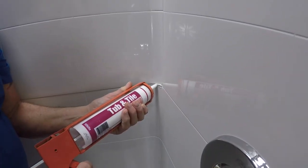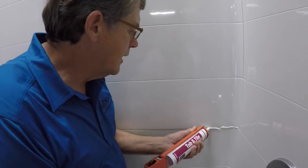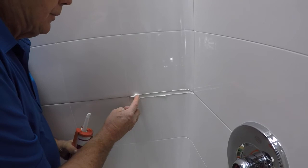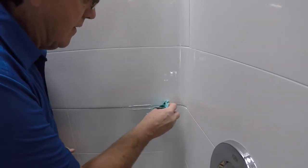The unit is designed to allow a one-eighth of an inch gap at the seams. Caulk all seams as well as the front edge of the threshold. Do not use your shower until the caulk is cured. See caulk instructions for cure time. A premium caulk is recommended.